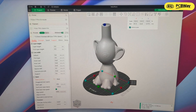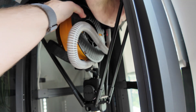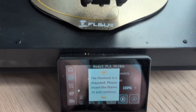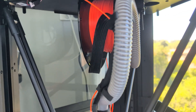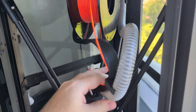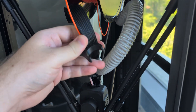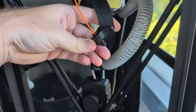Let's do something more intense. I scaled up this Pikmin design to around 250%, loaded up a fresh roll of yellow PLA, and started the print. The first few layers were looking good, so I went away — and then the filament runout detector had triggered because of a huge filament tangle. I think after the printer auto-leveled, it raised the extruder back up, which pushed the filament off the spool, and as it went to print again it got tangled. Or it might have something to do with these clips — they don't stay in position, they make the filament bend at sharp angles, and sometimes they just get pulled off from the filament being dragged through them.